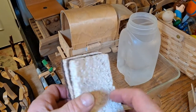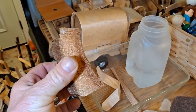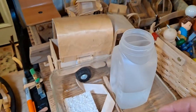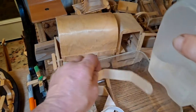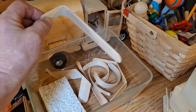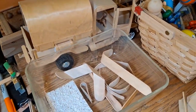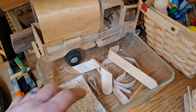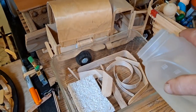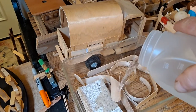When the tree was alive, it was full of water. Now that it's dry and dead, there's no water in it. But if you give water back to the stick, you will start to be able to bend and mold and shape the wood almost as you desire. One of the things that we do is called re-soaking. If you don't like a particular bend, you can simply re-soak the stick. The stick will want to go back to its original shape and become flexible again. That's called re-soaking.